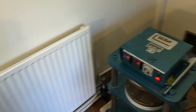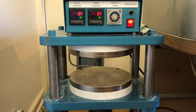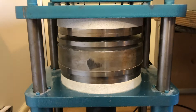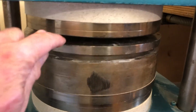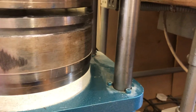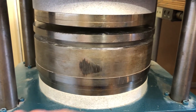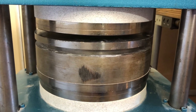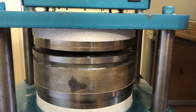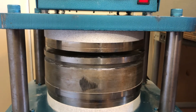I'm going to take it over and stick it in the vulcaniser. There's enough gap for the can to get in. Now we have the mould can in the vulcaniser. I like to make sure it's fairly central around the plates — I can feel it's slightly more over here, so I'll just nudge it. Bear in mind this is hot but it's only around 90 degrees, so I'll be very careful not to touch the plates. Keeping it central ensures the pressure is going to be evenly applied over the can rather than creating a slope in your mould.